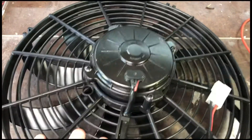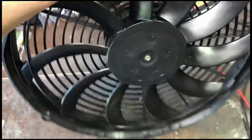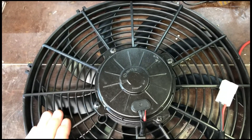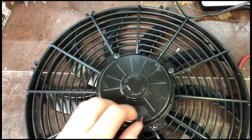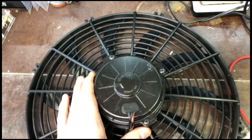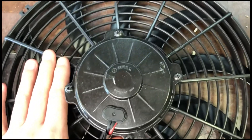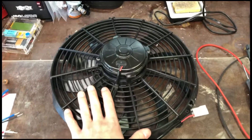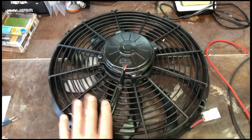This is a balanced unit at the factory. SPAL will not repair it. You can't change the motor on it because then the balance will be off and cause it to fail again. Pretty much when one of these goes bad it's not repairable unless you find a way to balance it, but SPAL says they won't repair them - if it goes bad, throw it out. It's probably not the fault of SPAL why it failed; it has to do with using a PWM controller. SPAL says do not use PWM, or if you do, use a seven kilohertz switching frequency, which was not the case with the Flexalight controllers I had.